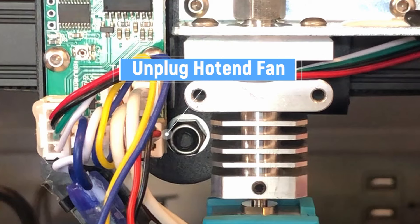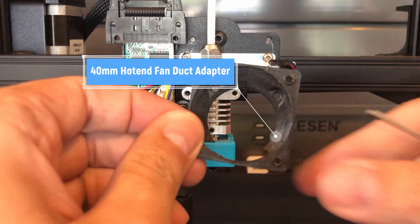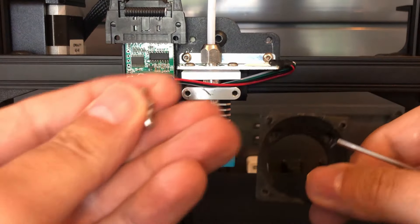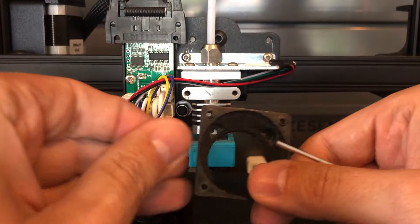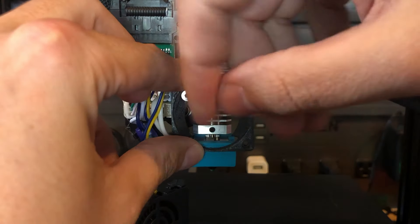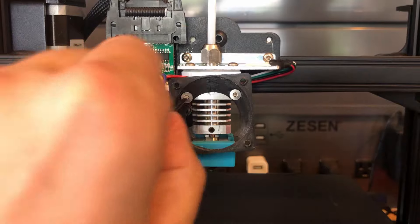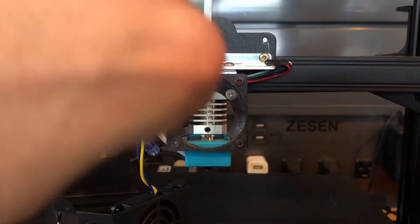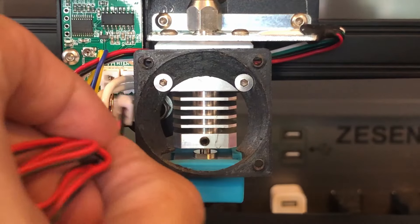Creality has a hot glue addiction, so please be careful when removing the hotend fan plug. I have the 3D printed part here — make sure it's printed with high-temp materials. We have two M3x8 screws, and you want to pre-thread these. If you try to thread them while attaching to the hotend, you're going to have a fun time. Do yourself a favor — pre-thread them. It will make it a lot easier. Trust me, I had to reshoot this about 4 times before I gave up and pre-threaded. The cooling block is likely aluminum, so don't over-torque those screws or it will strip.